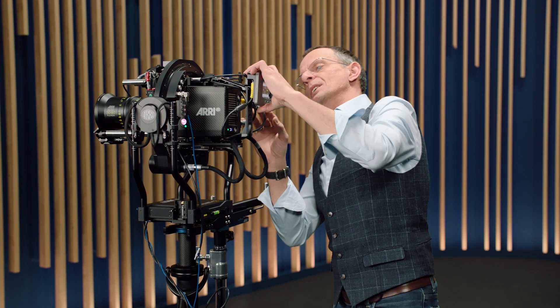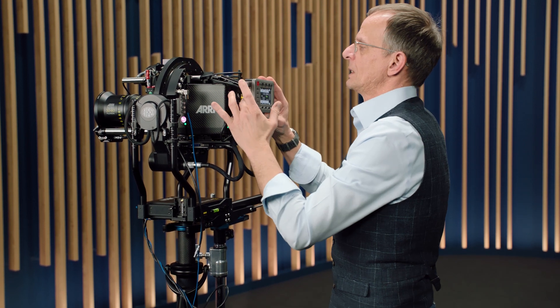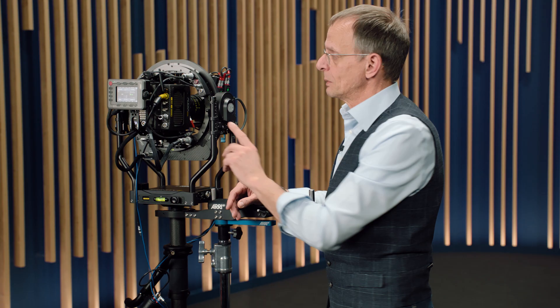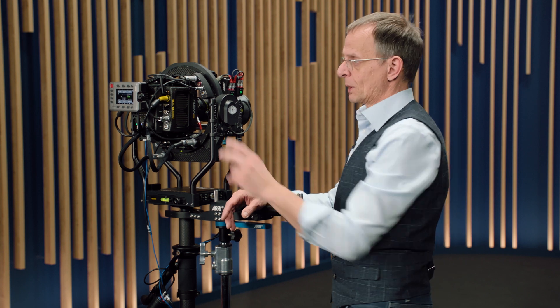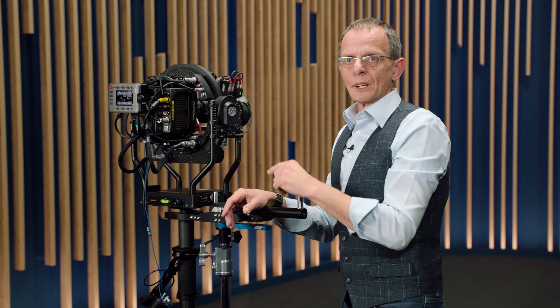Let me tell you what is the idea behind this. Let's say this Mini and the Trinity is a part of a multicam production. This production is asking for the best picture quality, which means we have to have dual HD-SDI out here, which is not a good thing for the operator because it means both B and C sockets will go to the OB. So there is no way to have a monitor picture.